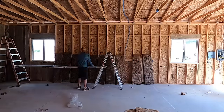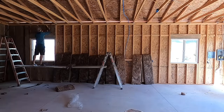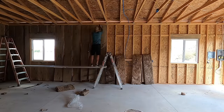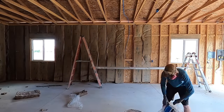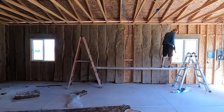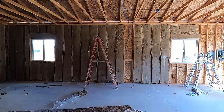Next, I just got to do the insulation, and this wasn't hard. It was just kind of tedious. I think it was R19 or maybe it was R13 batts. Got them in like 32-foot rolls and just cut them to the length I needed and installed all the insulation. And then I will be doing spray-in insulation on the roof or inside the ceiling and attic.